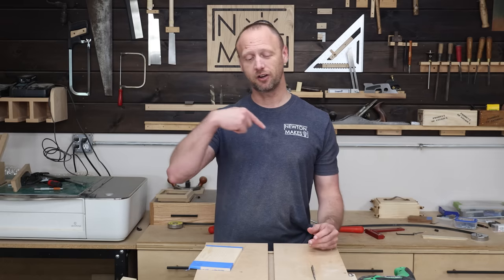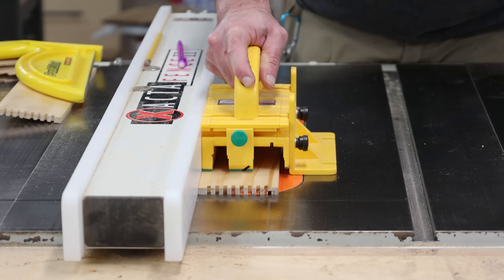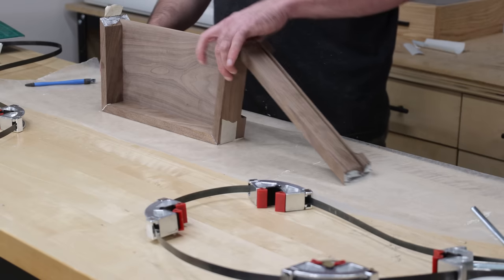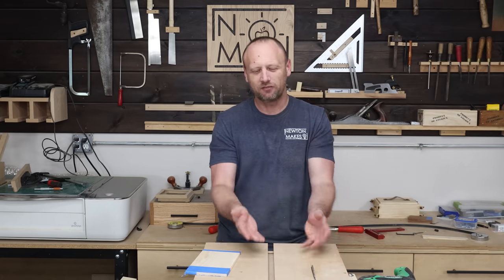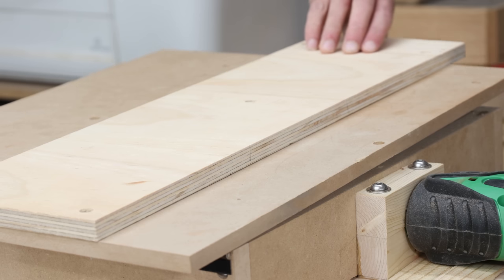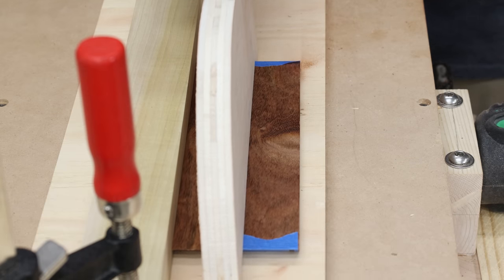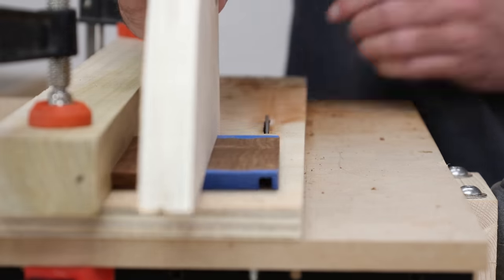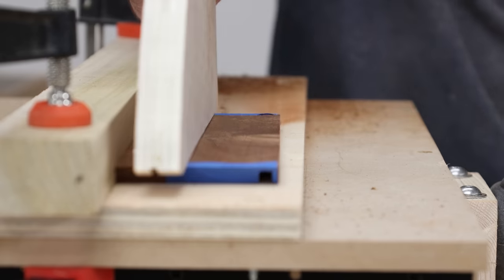Typically whenever I'm making a box, I'll channel the inside faces of the box sides so I can just put the box bottom into place. I do that over at the table saw or the router table, usually the table saw. Well, my table saw here is not adjustable — I can't just lower the blade down. So I have to raise the actual surface of the table saw itself. I found a piece of scrap plywood. If I screw this down onto my table and run my box sides across, the blade is just poking out, so I should be able to run the box sides over that and cut a channel in them. The bottom will fit into place.